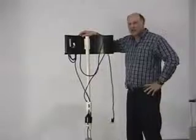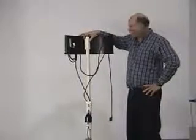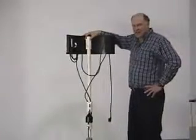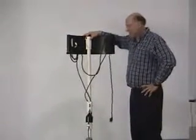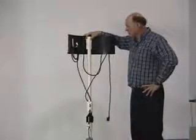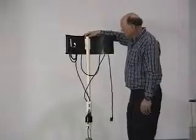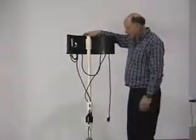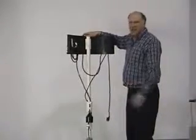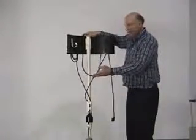Now, let's say we're back to service a pump chamber a year later. This system has our float tree system in it. This makes it very convenient and safe to service. There's a lot more emphasis today on keeping your head out of the system to not get down into the dangerous gases. This also allows very easy replacement of floats, as well as if you need to service a pump, now your floats are all separate from your discharge pipe and your pump.